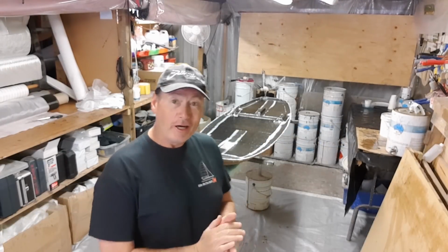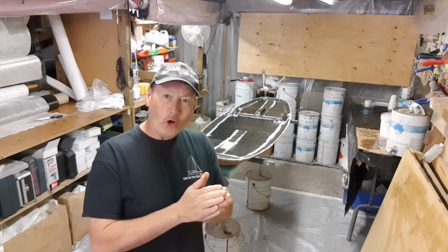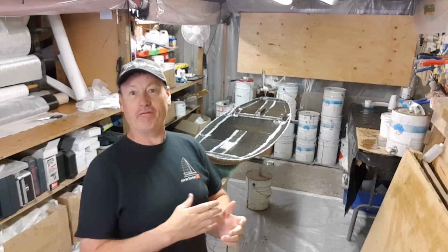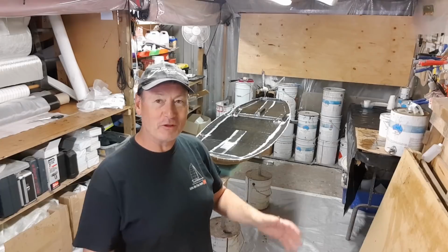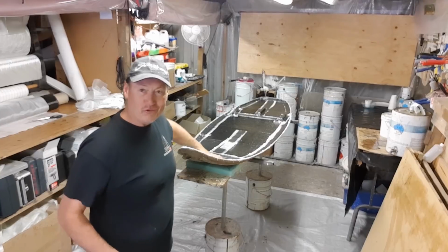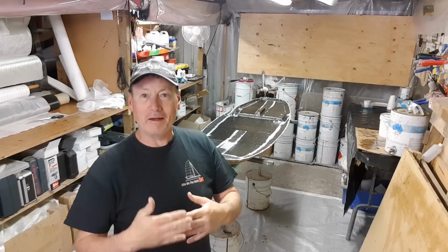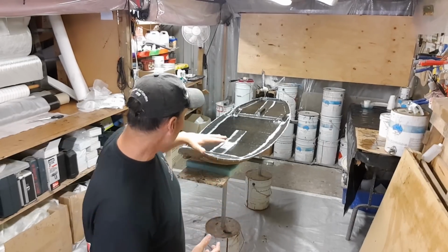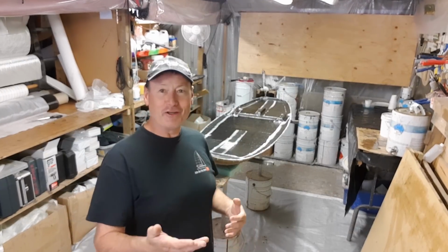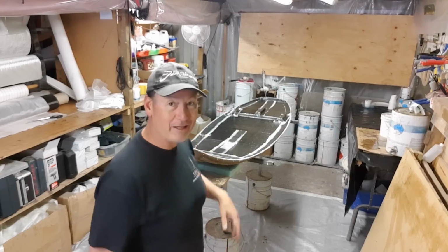So yesterday afternoon, I laminated this carbon reinforced Surf Kayak hull, and I'll basically always leave it overnight to cure. There's no point in trying to demold something on the same day unless you've got like a 40-degree day, you've got an autoclave oven where you can whack it in and force cure it. And essentially, you don't want it green or just a few hours old before you demold it, because you may well delaminate something that hasn't quite cured. You don't really know what's going on in here, especially under 5 layers of laminate. So I leave it overnight, give it at least 12 to 18 to 24 hours to settle. It's almost 24 hours since I laid it up.